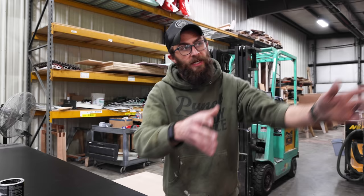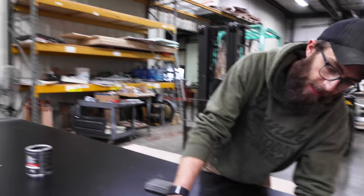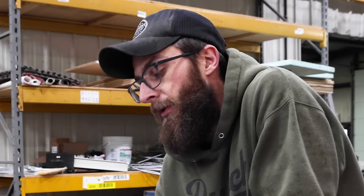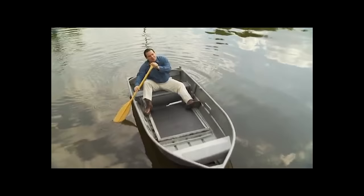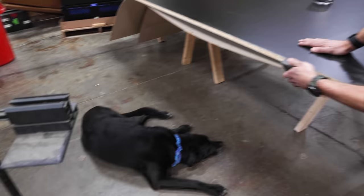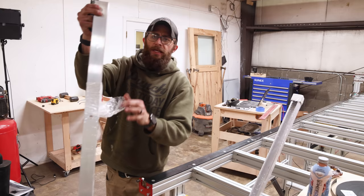The machine is finally ready for the vacuum table. We're using melamine and need to make it into an airtight box — the edges are no good as-is. We tried ordering edge banding but got the wrong kind. We're going to use Flex Seal instead. We start by taking a sanding block and knocking off the sharp edges on the melamine.